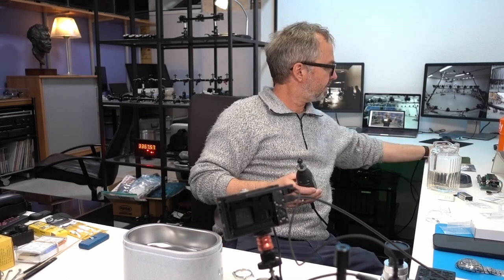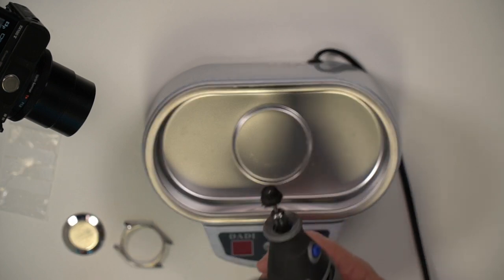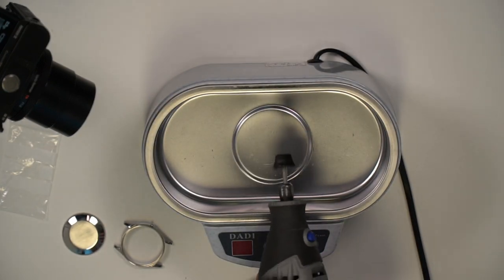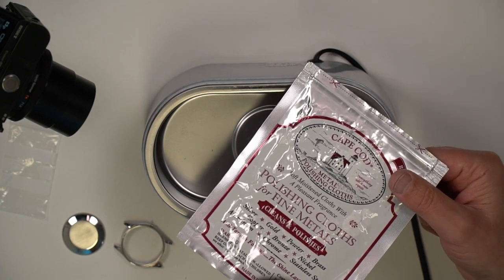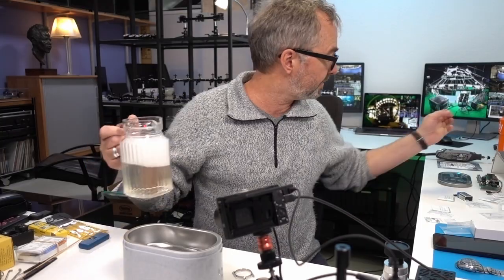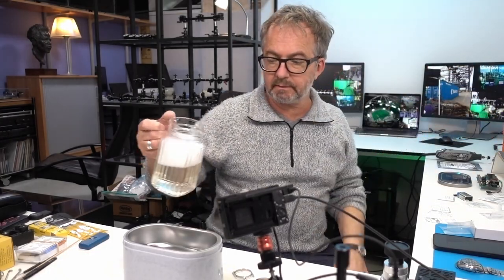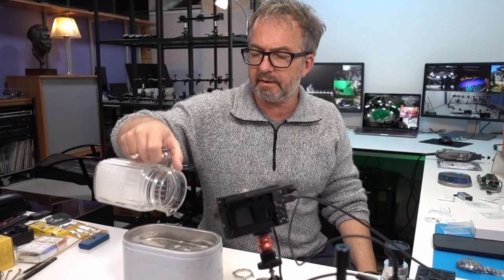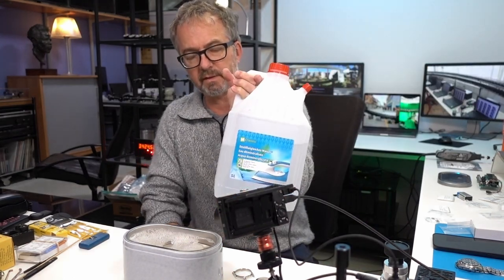To polish it, I used this green polishing wax and a Dremel tool with a cotton brush on the end. After that, I used Cape Cod polish — it's got some solvent in it, so it polishes a bit more and removes the wax. That's how it got to this point. For the ultrasonic cleaner, I'm using household dish detergent and warm water, because I'm cheap and the ultrasonic cleaning liquids in Switzerland are like 120 francs for rinse and wash. I'll rinse it with distilled water.